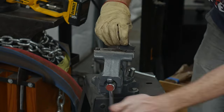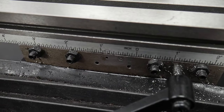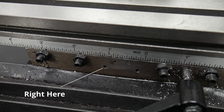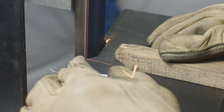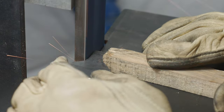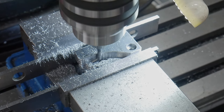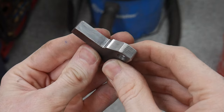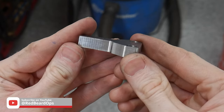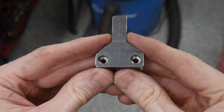The two holes need to be drilled approximately 24 millimeters apart to a diameter large enough to accept a 4mm bolt. The 3990 mini mill already has these holes drilled and tapped. I counterbored these holes to around 8.3 millimeters in diameter to accept the cap head screws. I was able to rough in the shape with my belt grinder and then brought the piece over to the mill to get the contact areas square and parallel. I was shooting for function.